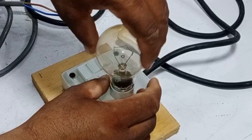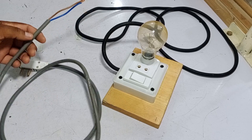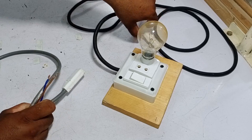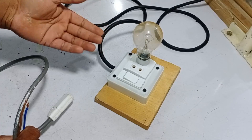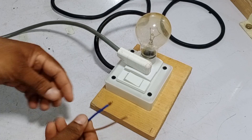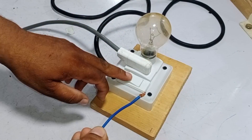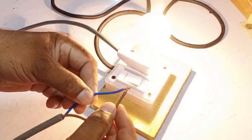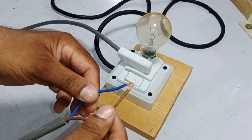Bulbs with low wattage can fuse quickly as they cannot bear the load. I have tightened the bulb in the holder. I will now test the series board by plugging it into an electric socket. I turn the button on and then off — nothing happened. I put the plug of the gray wire into the socket of the series board and short the two wires together. After turning the button on, the bulb glows when I touch the wires together. The button is installed for safety reasons, to cut off the electricity.